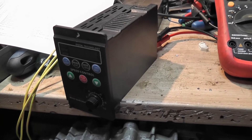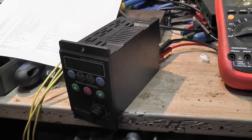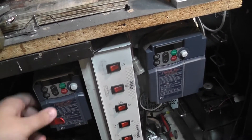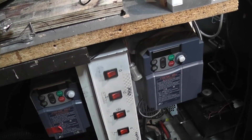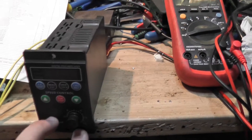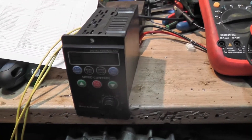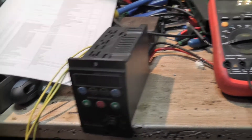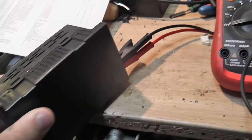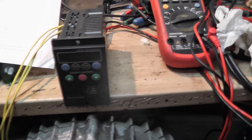For this project I got myself this little variable frequency drive. I have a few other known-brand ones from Fuji — a three-quarter kilowatt and a 1.5 kilowatt — but I looked for a way cheaper solution on Aliexpress and found these. They only cost about 40 bucks. They can be controlled via RS485 and a 0 to 5 volt signal, and they seem to work fine.